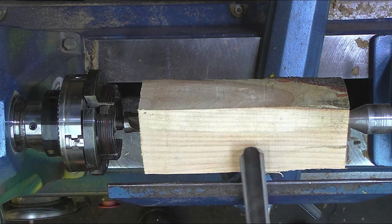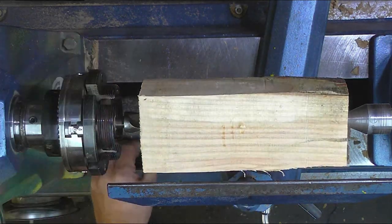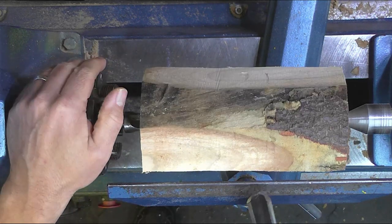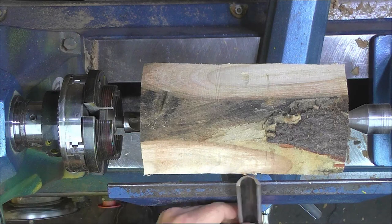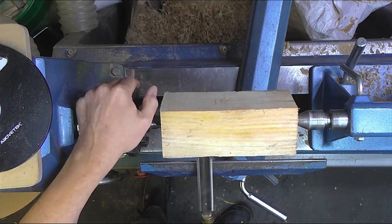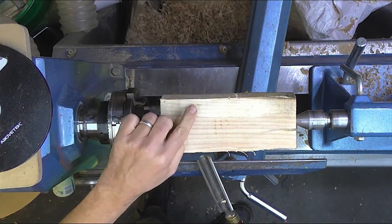Now it will cut if you put it straight onto the wood, but it's quite a bit of an effort. It will cut more easily if you just angle it slightly and you get a little spiralling cut. Maybe we'll be able to show that a little better once I've got it a bit round. There's a little spiralling cut rather than this great big wedge of wood that comes out. In terms of preparing the tool, you obviously have your wood spinning first — you don't just stick your gouge in because that would be foolhardy and cause a big bang. You're going to start by putting it on the tool rest, making sure it's not catching the wood, and then you lift the handle up. If you just lift the handle up straight away, you're going to get the heaviest of those cuts going in. So it's better to have it at a slight angle and you will get those slicing cuts, a little spiral going in the wood — much easier to cut.